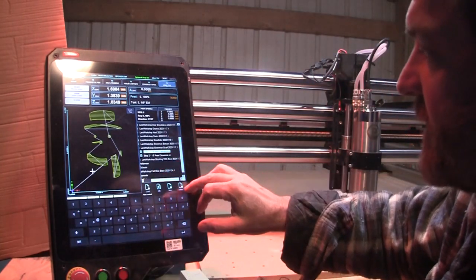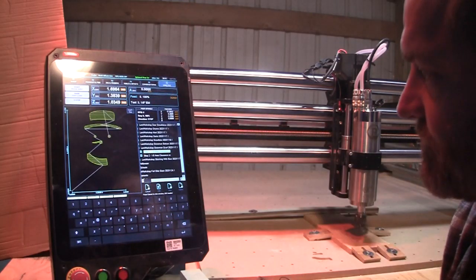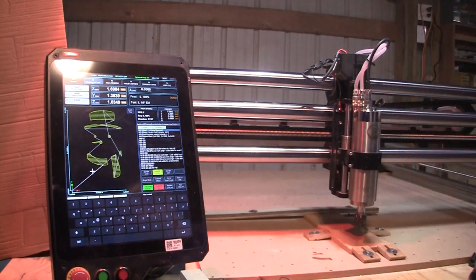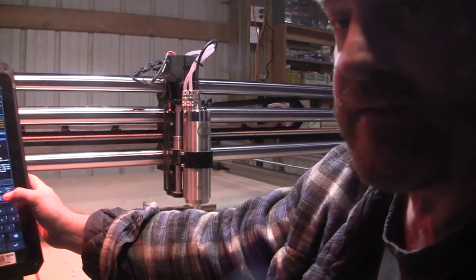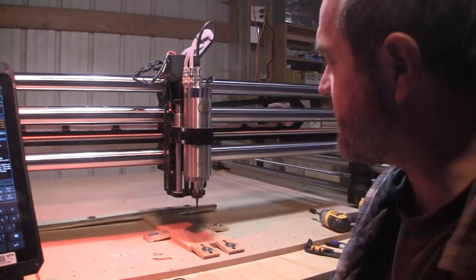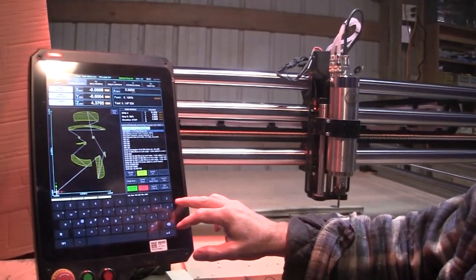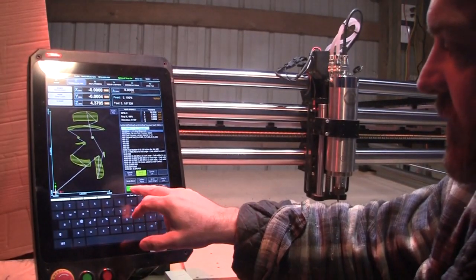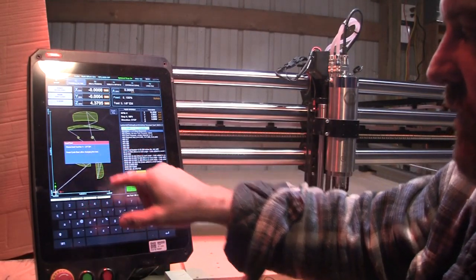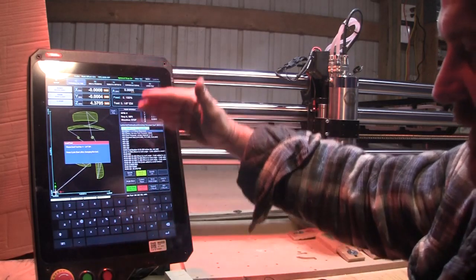So we're going to load up the one quarter clearance. It'll load the screen, and then we're going to go back to program MDI. Now, my origin, you're going to see this pop up, and it's going to pop up to about here. So there's my work origin, same as everybody else. We're just going to come over here, hit rewind, then we're going to hit cycle start. It'll tell me load the 1/4 inch EM, which comes from the T4 M06,